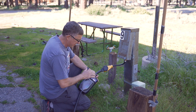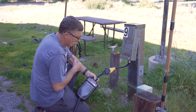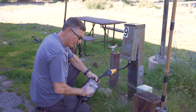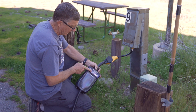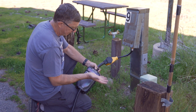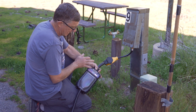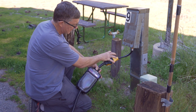Most of you have heard me talk about the Progressive EMS box before. One of the things I enjoy about it is it tests your voltage and amperage right at the post — you can't do that inside. With my 50 amp disconnected, I can still read the post. It's showing me leg one powered up with 9 amps flowing and leg two at 124 volts, 3 amps at 60 hertz. No errors — E0 means no errors. Leg one reads 123 volts, testing how the power is coming in.